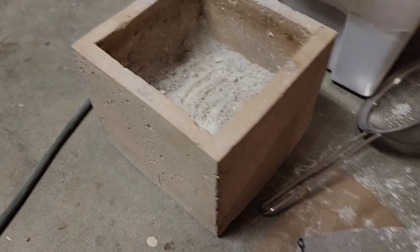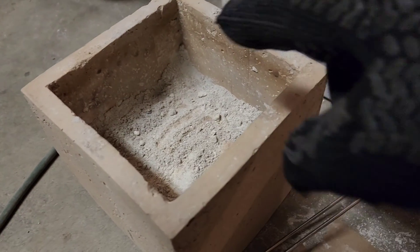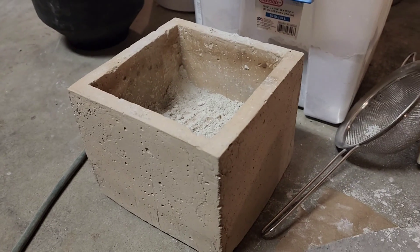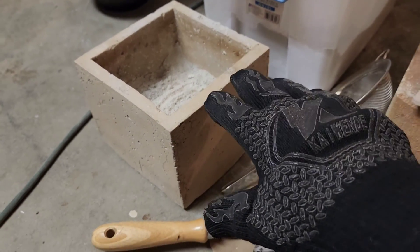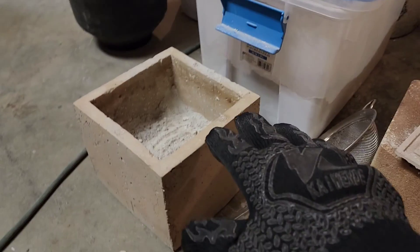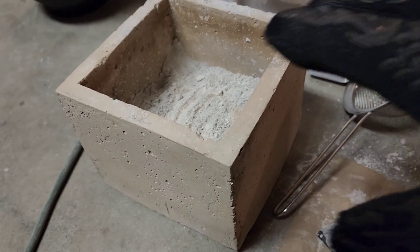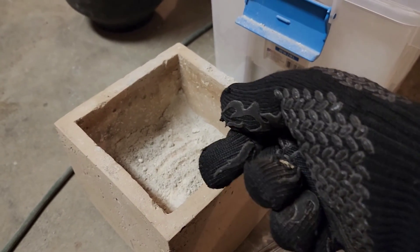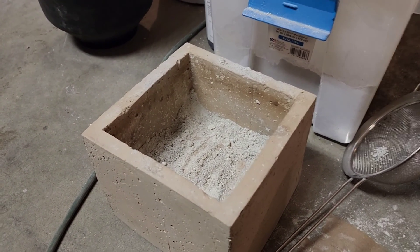We go about this by clearing out the ballast on the surface, and we've placed a single element inside the ballast, supported about a couple inches up. This is my largest crucible. I'm trying to see where we can max out with this size because it takes up a lot of space in the microwave and gives a lot of options. I'm leaving an empty layer so I can check the temperature with an infrared gun, and we'll be doing 10-minute bursts and recording the results, graphing those out.